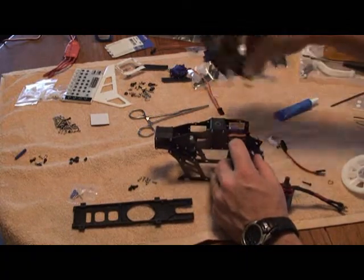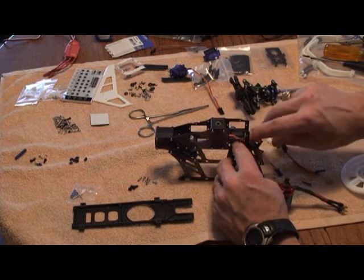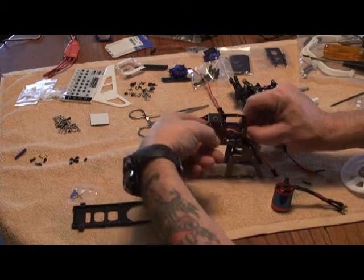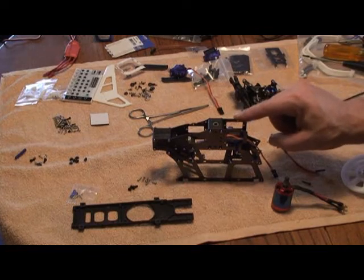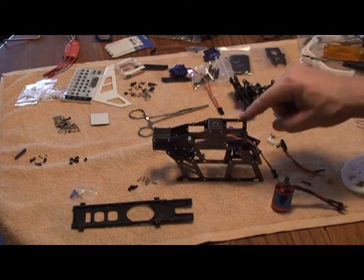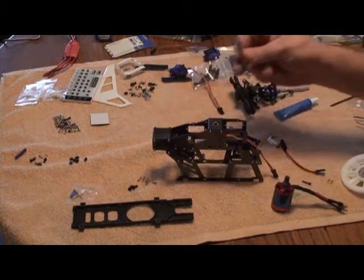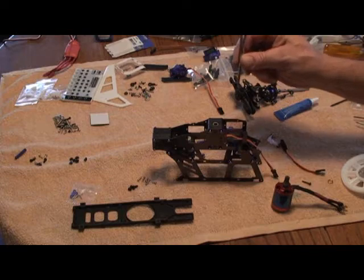We can remove this to get it out of the way. It comes with plastic nuts for the back sides of the screws. The reason you don't want to mount anything else is so you can get inside and hold that plastic nut on the bottom servo. One item to keep in mind — a pair of medical hemostats are great for holding these plastic nuts while you run the screws in. I'll go ahead and put the screws in with the plastic nuts and get the other two servos mounted.